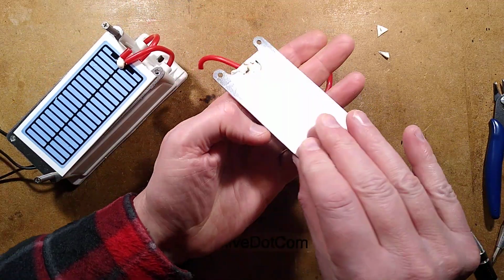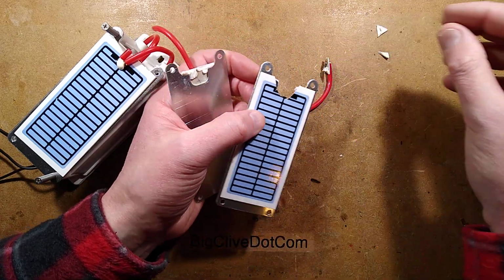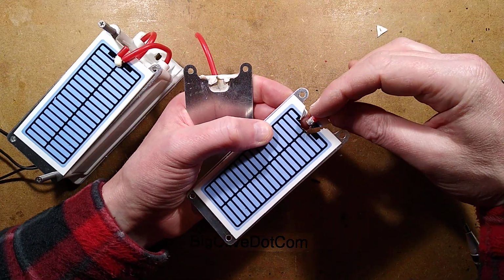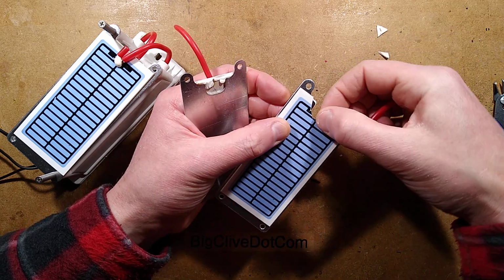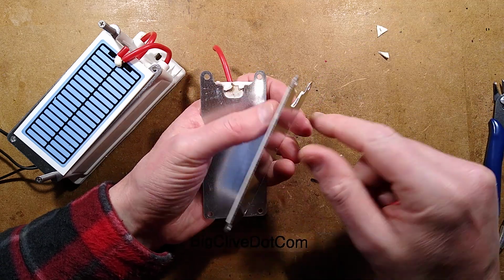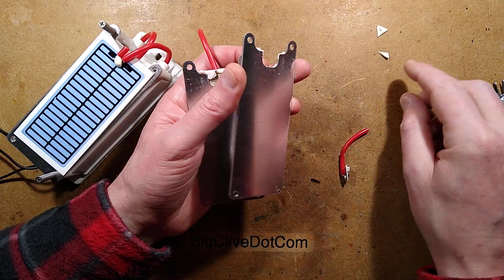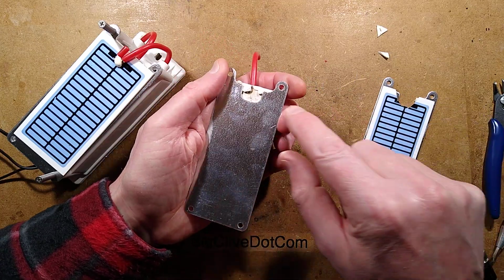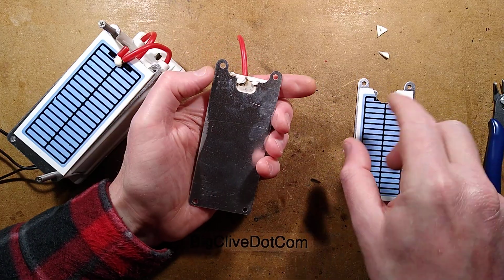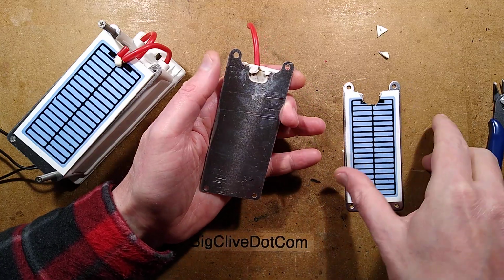This plate appears to have survived. This one, when I attempt to take it apart, it's clear that that's where the crack had been, basically pressure being applied to the top of this cable in shipping, and it had cracked this because there's no support there, because that is where there's a little bond from the back of this plate with a solder connection onto the back of that plate, because these circuit boards have a metallized coating deposited on the back.